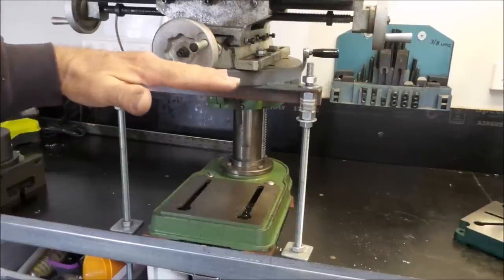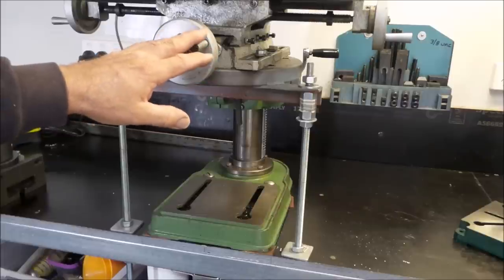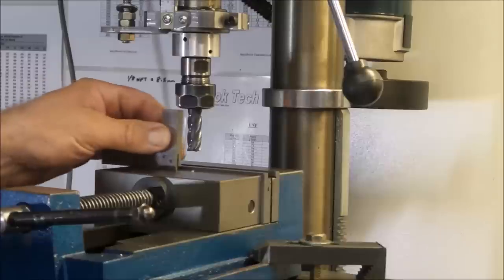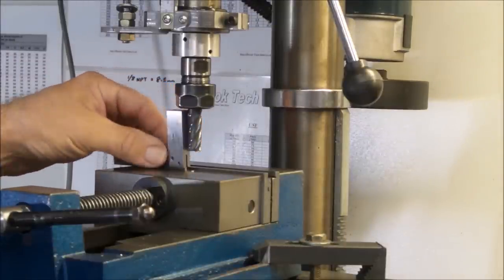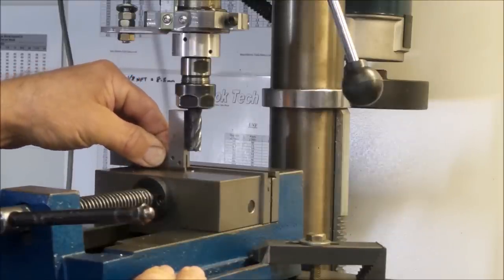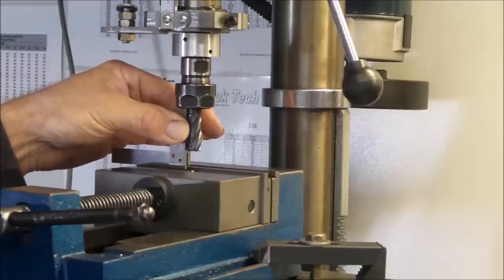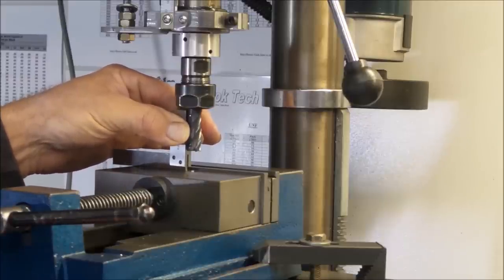And what that does, that allows you to get your workpiece or vise or whatever you've got on the table completely square off the cutter, which is really, really important. How I generally achieve this is with using small machinist squares that I can sit either on the workpiece or on my vise. It's quite precise and the surfaces are quite flat and square. So by holding your square against the cutter and dropping it down onto your vise or the workpiece, you can eyeball it and see whether it needs to go up or down on one side.